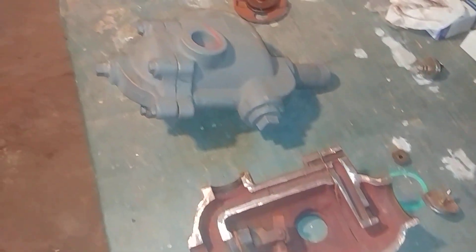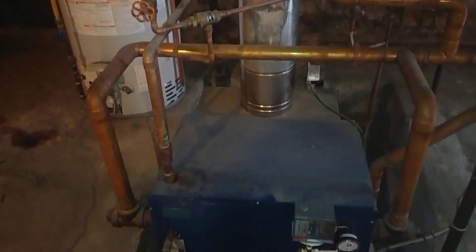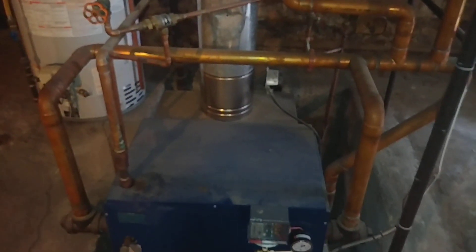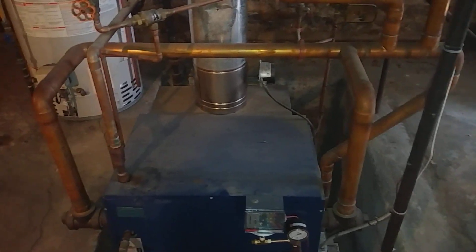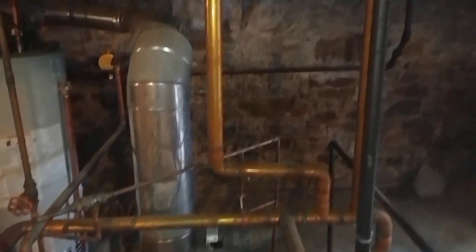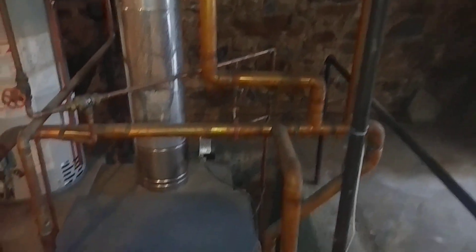You might want to see the boiler - sitting in its pit there. It's an old Columbia, put in wrong. The header is not three-inch. We can quibble about whether it's copper or steel, but regardless, the header is too small - that's in the instructions. Copper is also not advised. There is a good riser there, so that at least dries out some of the steam.